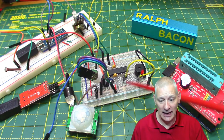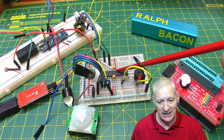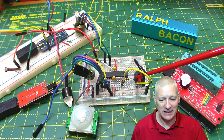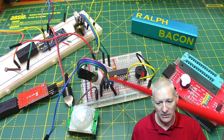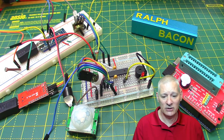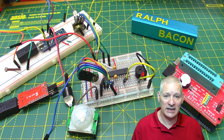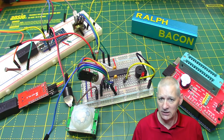So the big question is really, what did I get the power consumption down to? Well, with nothing attached to this ATMega328P, did I say that right? ATMega328P. So just, okay, we have the beeper attached and the LED attached, ready to indicate that it's on. Couple of capacitors, not to the PIR and not to that variable resistor. What was the current consumption? And we'll have a look at that in a little bit more detail right at the back. I'll give you a couple of screenshots of my multimeter and stuff like that showing the power. But I can tell you I've got it down to 0.3 of a microamp, which is within the spec of the datasheet. That's what it should be.